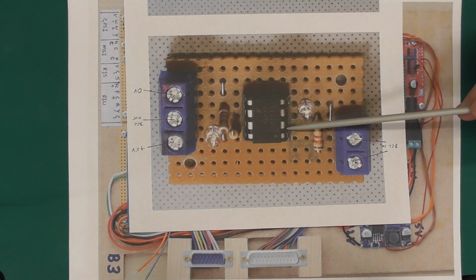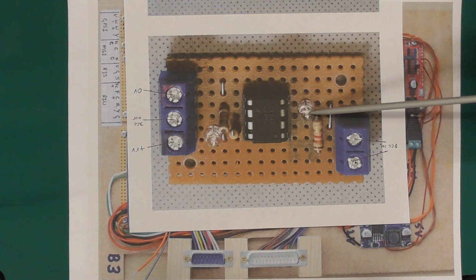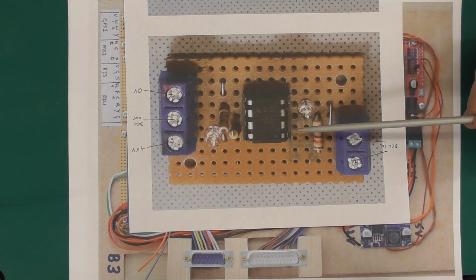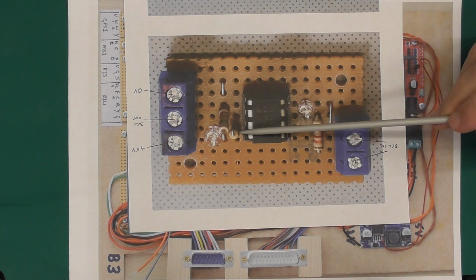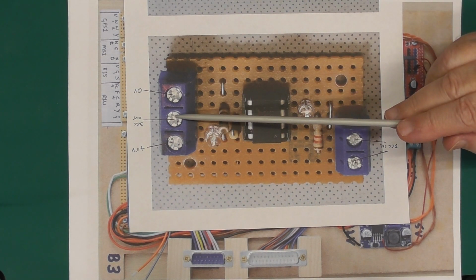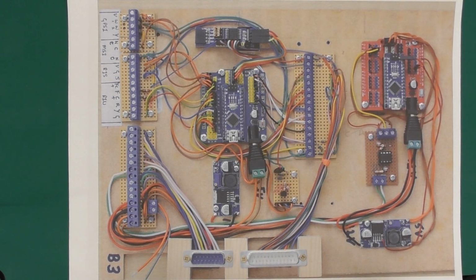So into those 2 pins on this side goes the DCC via a resistor, and this diode is backwards across the one in here, so this diode in here flashes at the rate of the DCC signal, and that flashing, i.e. the signal going up and down, is what contains the information. Out of here we get a 5 volt signal, and there's another LED there so I can see it's happening. There's 5 volts and 0 volt going here to power this, and out of here comes the 5 volt version of the DCC. It's a pretty well known circuit, it's used everywhere.